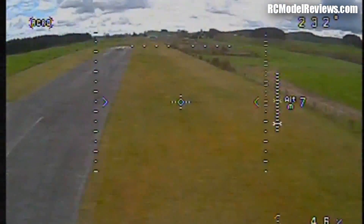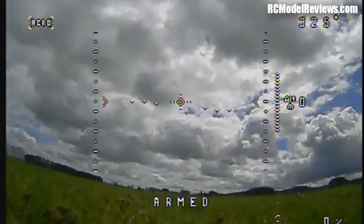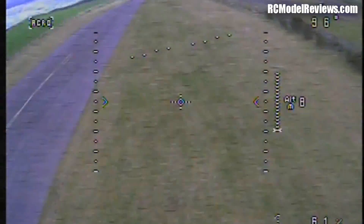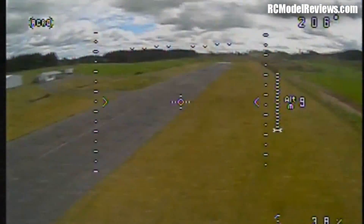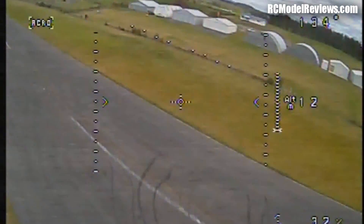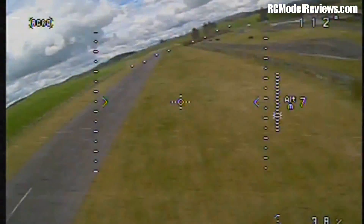Then I put the goggles on and it all started going pear-shaped. First, the antenna is really really crap — I was getting dropouts within 50 meters, and at 100 meters it was getting worse. More importantly, there's something going on with the video signal. It started off with a little bit of patterning when I arm it — doesn't show up as much on the DVR footage because DVR compression smooths out some patterning artifacts — but as the battery went down the patterning got worse. I'm running a four-cell graphene pack. Eventually it was almost impossible to fly because the patterning was so bad, and it looked much worse through the video goggles. With any load on the battery, any power coming out of the motors, the picture was so bad I couldn't have raced with it.